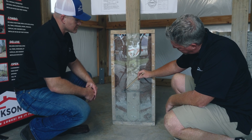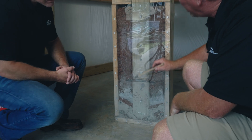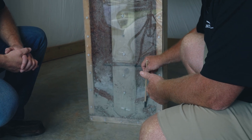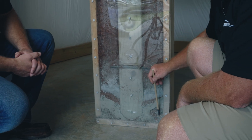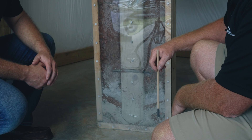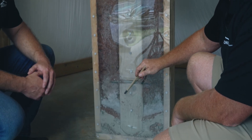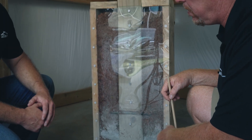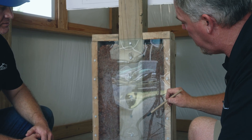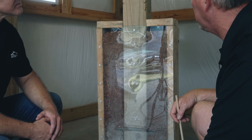They mounted the post in and put the half-inch rebar through, extending it through the post as called for in the drawing, but the rest of this is backfilled with dirt. They're hoping that eventually enough water will make it all the way down to get this concrete to lock up. This will never achieve 3,500 psi, and it's never going to encapsulate the rebar for the uplift capability shown on this drawing. What you also have is dirt and water constantly in contact with the post below grade — if you get 10 years out of it, you'll be lucky.